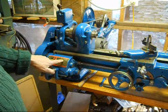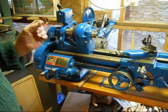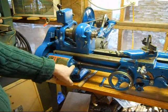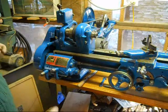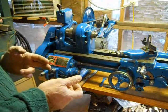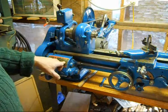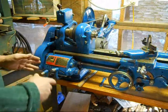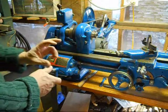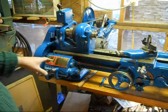the first 5 gears in the gear cone actually have a dowel pin going through them that locks that keyway in alignment. As you're pushing that shaft in, this middle shaft on the gearbox that all the gears sit on, you have to put those gears on basically one at a time. And as you keep feeding it through, you might have that gear on there, but you're not engaging that keyway into that gear until you're way down working on the other gears. You have to make sure you spin the keyway on the gear so it aligns with the key, so as you keep pushing the shaft through there, it aligns up on them.